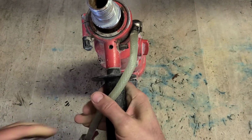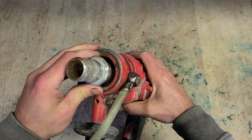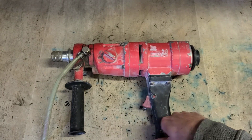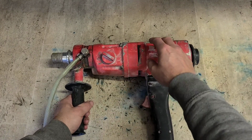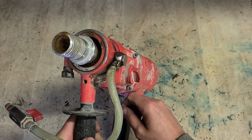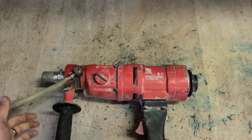There we go. Wee bit of a growl out of it. It's the head here. She's just starting to rust inside of here. I'll just make sure of that. I'll give the customer a ring. Nope, no need to ring the customer. It's written on the side of the box: seals in the head. So yeah, it's to do with this rust here. Seals are gone in here. It must be leaking water out all over the place. These seals have failed and they need to be replaced.